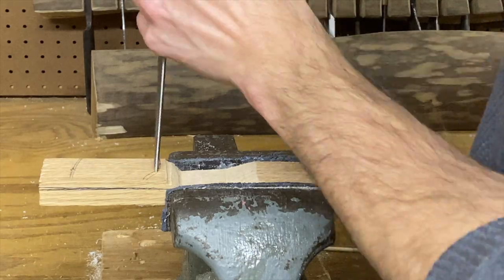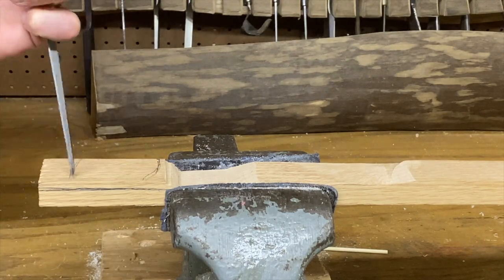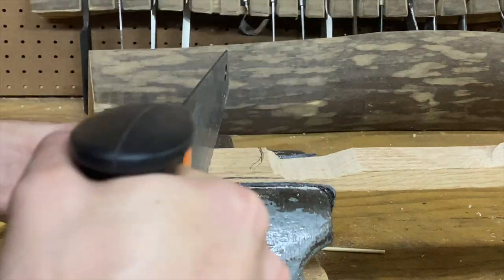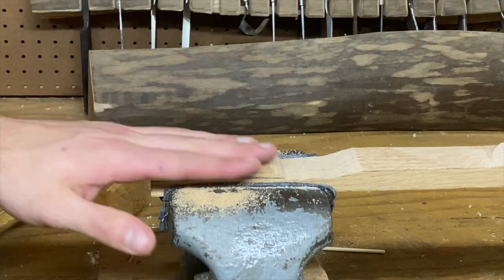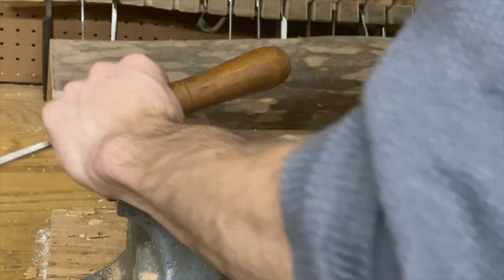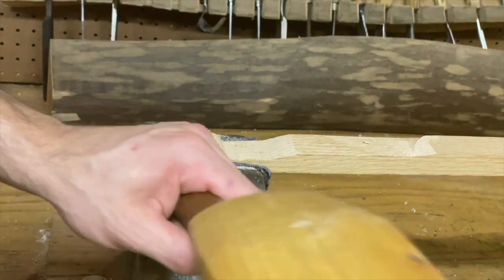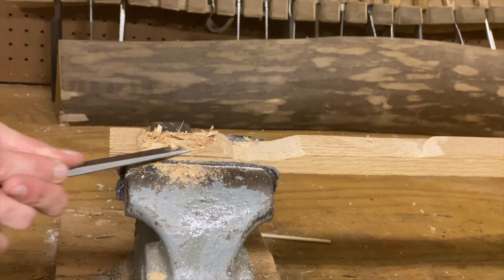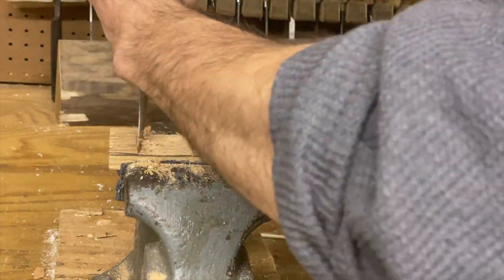Now I'm carving the other side of the trigger housing, the one that goes on the magazine side of the device. This is just a negative space that lets the trigger move freely, and it offers a hard boundary for the forwardmost and rearmost trigger positions. An easier way to carve this part would be to plane the whole end down to that line I'm carving to, and then add back the hard stops, rather than carving away the negative space.